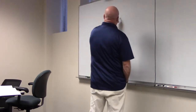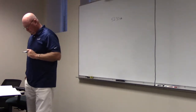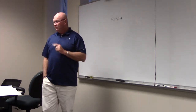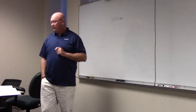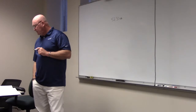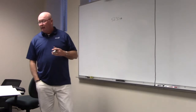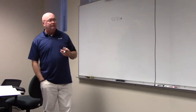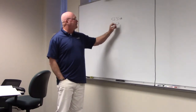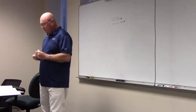5,230. All right, that's volt amps right now. Now what do y'all think by looking at it? What is our range kW going to be? Looking at your table, what do you think the range is going to be? Column C. Column C, and so how much is the kW going to be? 8. Not 12, but 8. 8 kW is how many volt amps? 8,000. So that's our range. Y'all with me so far? So we're writing that down.